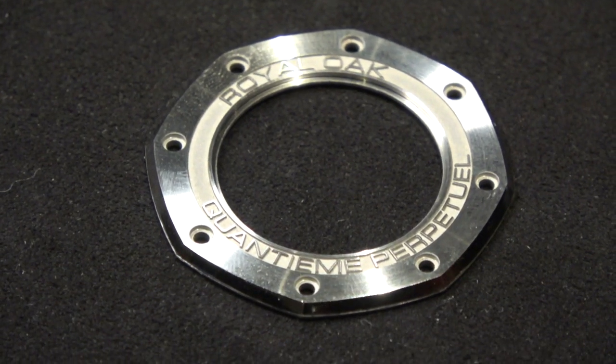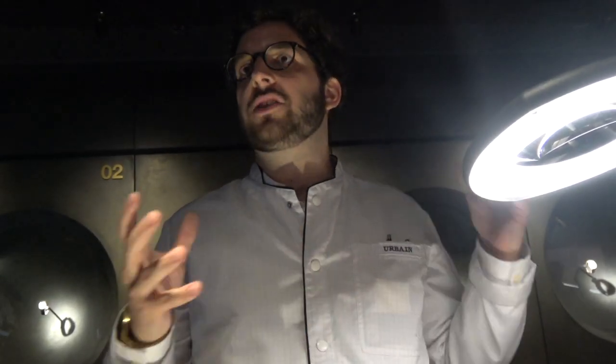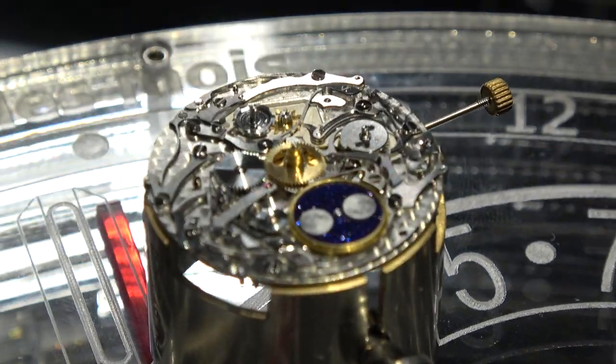Wow. When you have a watch back for service, what kind of process does it go through? So we disassemble the watch completely, as well as the case. You have to know that a mechanical watch is just like a motor car, the motor needs oil. With cars, when you drive, you have to do a service every year. The watch is more like 5 to 7 years. But the process: we disassemble the watch case completely, the movement too. We clean it at least 2 times to make sure that all the old oil is gone. Then we reassemble it with all the oilings and make sure that everything is set up correctly. Of course, a watch like this requires quite a bit more time because of the complexity of the movement. Thanks so much. You're welcome.